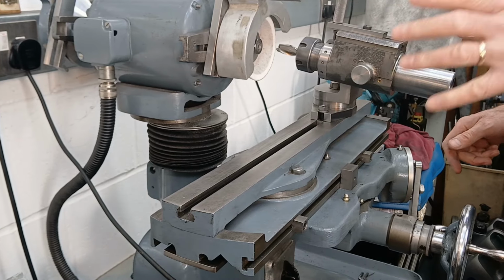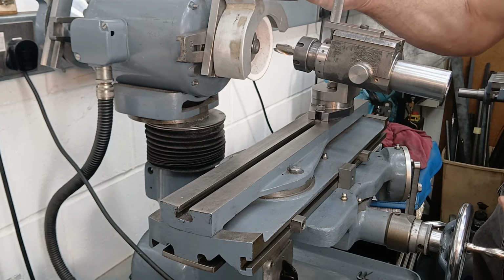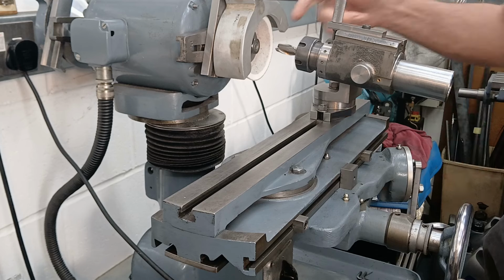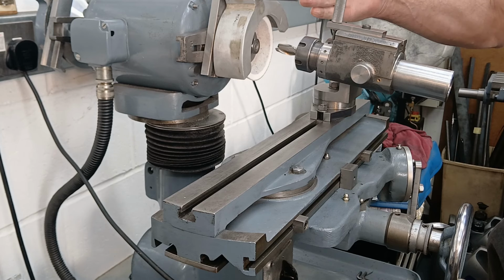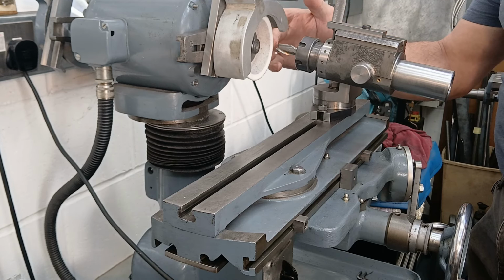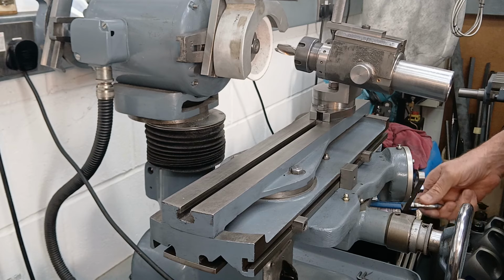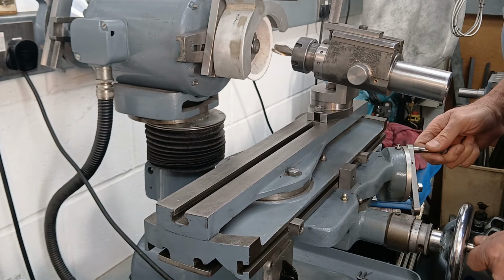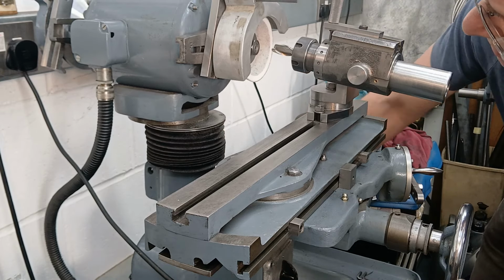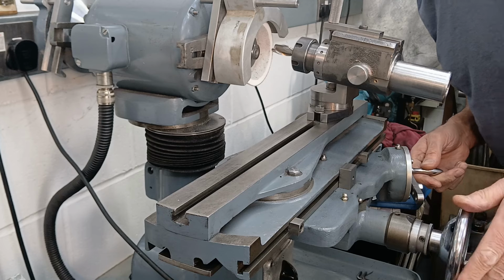One thing to be careful of though, doing the primary relief, because we've got an angle on the cutting edge, if we simply swipe right across the wheel like that, we'll wipe out the opposite corner because everything's angled in very slightly. It was okay for the secondary relief because the angle is so slight that it misses the far corner. But now with the primary relief, we have to just come in to the point, get it onto centre of the wheel first, all with everything turned off, obviously.